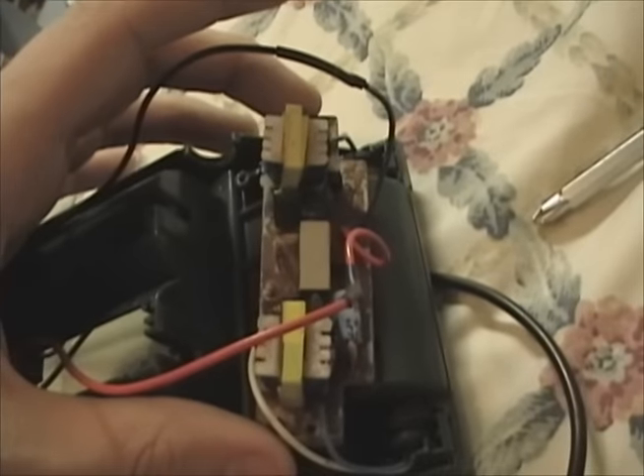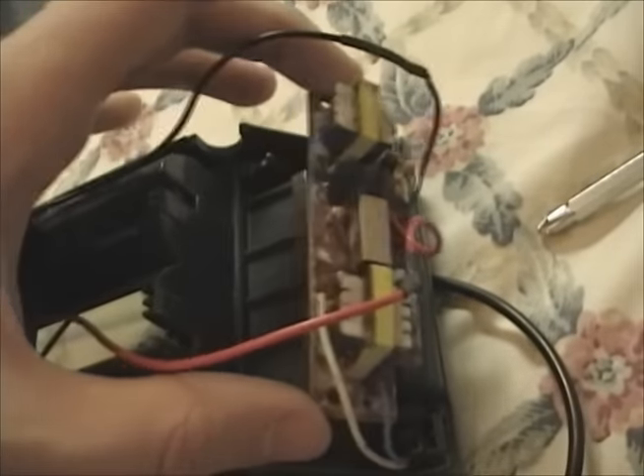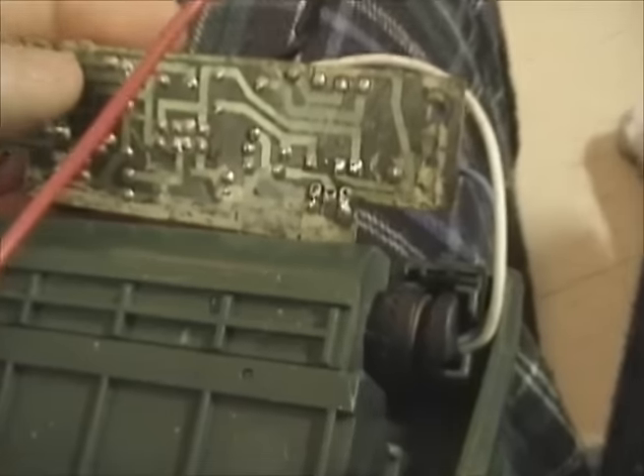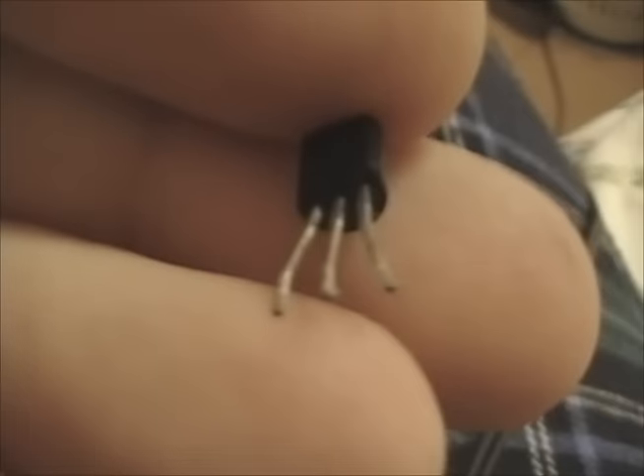So I have a decision to make - is this thing worth the dollar sixty-five to replace the transistors? How about this: I'll remove the bad transistor, and if I can do it without screwing up the traces on the circuit board, then I'll spend the dollar sixty-five on new ones. I got it out without any damage. I retested it and it did test bad. So I guess sometime in the near future I'll buy some of those and see what I can do about fixing this thing.